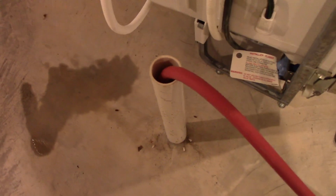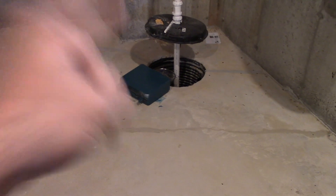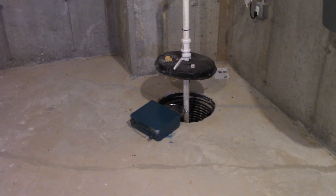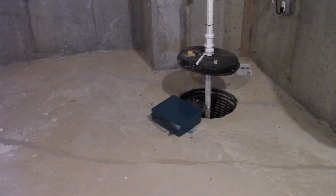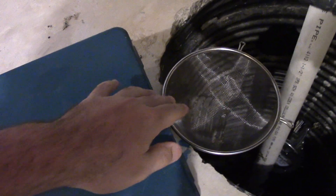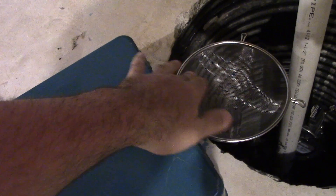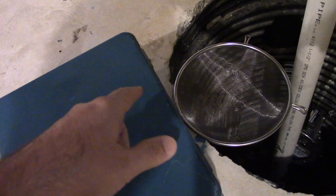And it looks like for the most part now the water has stopped coming out. So now we're going to go ahead and move the hose over to the sump pump. If you're going to use the sump pump to drain the water heater, a couple things to take notice of. First of all, do not put hot water in there — do the thing of getting the hot water out by doing laundry or taking a shower first, because those pumps are designed to pump cool water, and if the water is too hot it can wear out the pump, make it overheat, break it down. Second of all, it's not a bad idea to get yourself some kind of strainer. What I have here is a kitchen strainer with a toolbox on top of it to hold it in place. Basically you're going to put the hose into that strainer so that any sediment that does come out gets caught there instead of going into the sump pump.